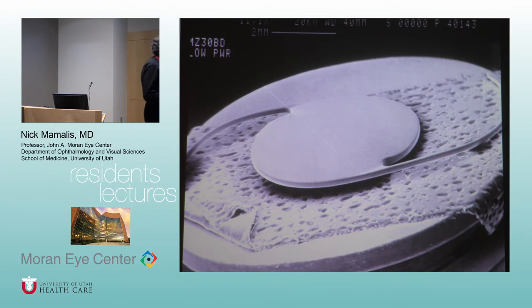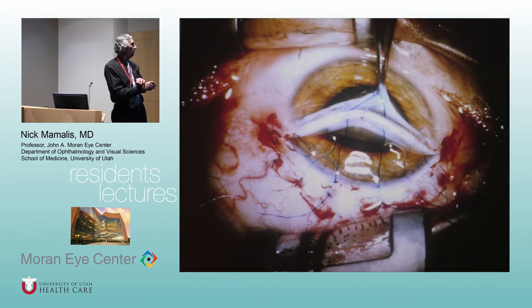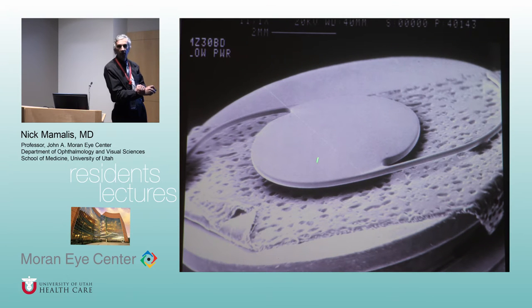As companies got better at making IOLs, they started making one-piece instead of three-piece posterior chamber lenses out of PMMA, using a technology called lathe cutting — a micro-lathe that cuts the lens like a cookie cutter. Then they would tumble-polish them: put them in a vat with little beads and polishing compound and literally tumble them for seven days. This is a one-piece modified C-loop PMMA posterior chamber IOL — look at how beautiful that finish is.